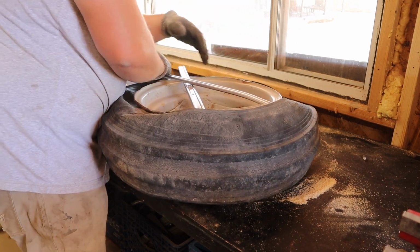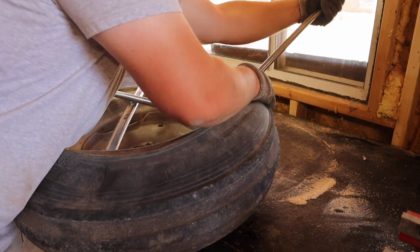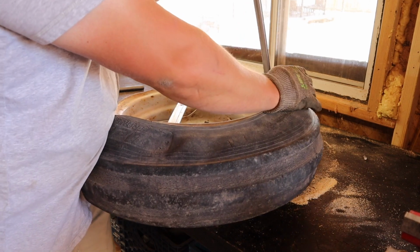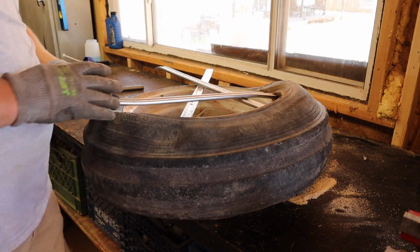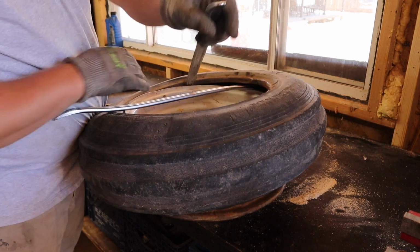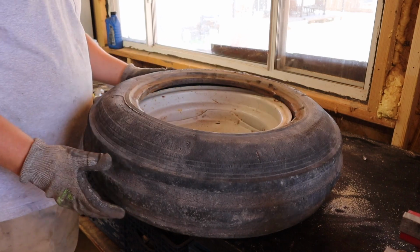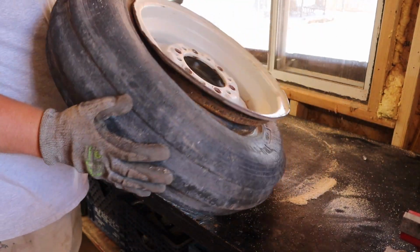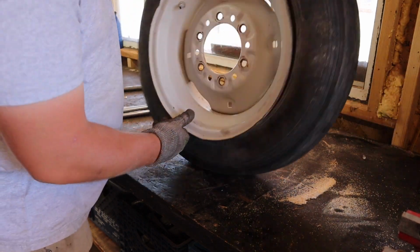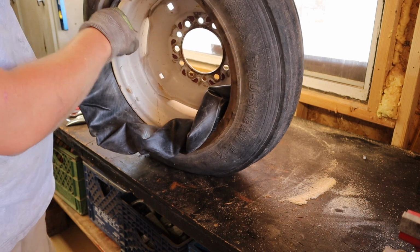But I've got 3 tire irons, and I just take the tire iron out of the middle and keep grabbing and popping them up with the hook-shaped end. And it all comes off pretty quick and easy. These old dry-rotted front tractor tires, at least on an N-Series tractor, seem to be pretty easy to remove. At least they were on this tractor. I think the tires themselves are pretty soft, and these are definitely kind of worn and thin, so they weren't too bad to work with once the bead was broken.